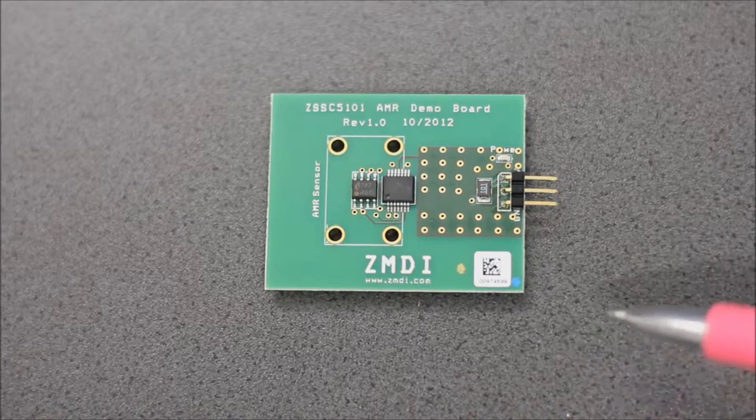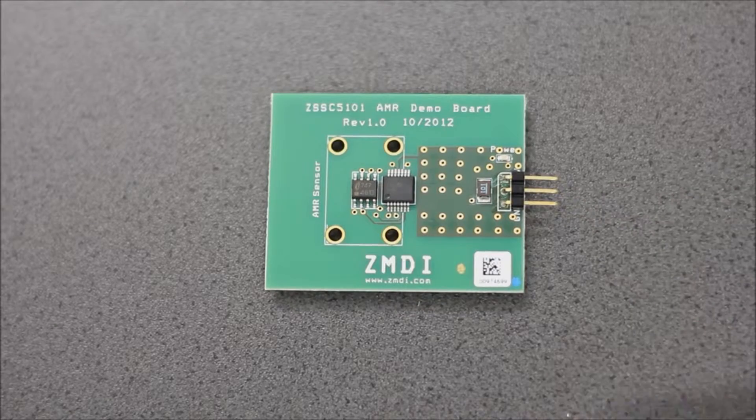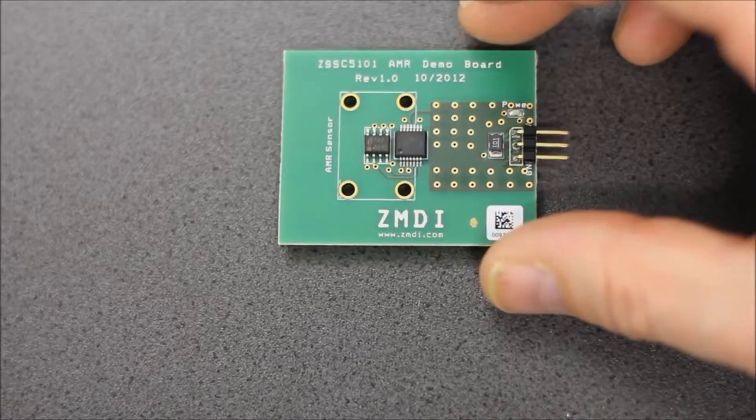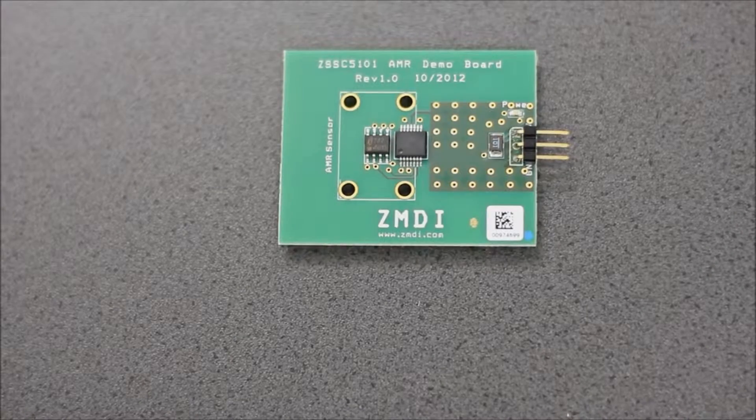You see it's only got three pins going to the outside: ground, the supply at 5 volts, and a ratiometric analog output. The whole module just has three pins and you do the complete magnetic sensing with this board.